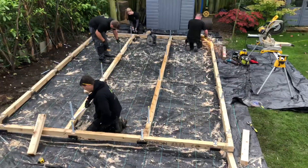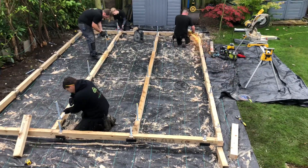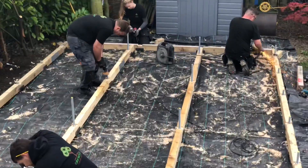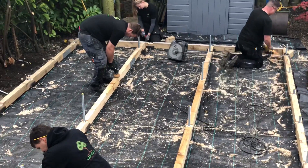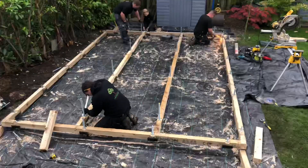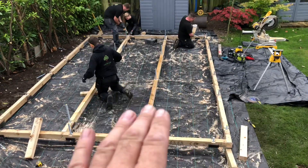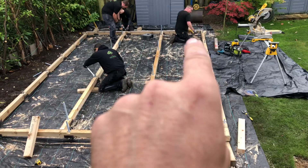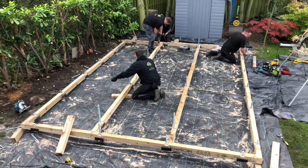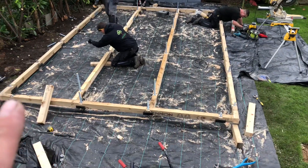So there's the base, practically in and done. Adam is cutting off the rod, Amy and Sean are putting the nut down, Amy is driving the 250mm screws in to keep all the frame tight together. We've got our three bases — one, two, and three. We've done that so the 4x2 hasn't got a big span, so it will be fully supported. Then we'll put our 4x2s across on joist hangers and fill with insulation. So that's five metres that way and three and a half metres that way.